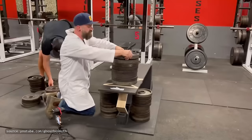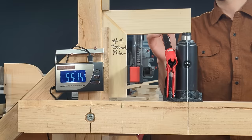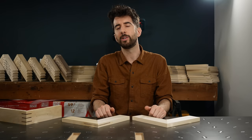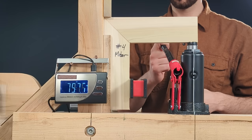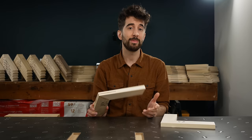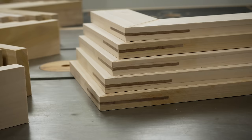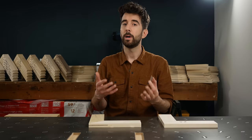The other thing to note is that in Jason's video he is squeezing the joint together as if you were closing a book, whereas I'm opening the metaphorical book. This just confirms the limitations of any joint strength testing — there are 101 ways that a joint can break and it's really hard to account for them all. These types of joints tend to be the weakest in this racking or rotational direction, which is why I tested them this way. The mitered spline is a great looking joint, particularly if you like to create accents with contrasting wood tones. If you want the clean look of the miter but are doubting its strength, a spline fits the bill rather nicely. Be sure to double check the grain direction on your splines — the grain needs to be perpendicular to the direction of the miter.